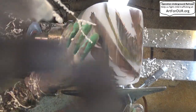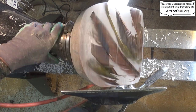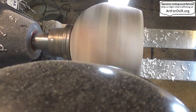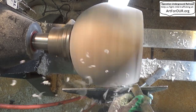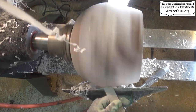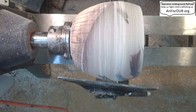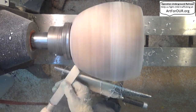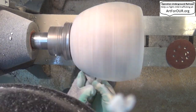One thing I've never tried before: I usually sand from 40 or 60 grit up to 400, 800 grit, and then go back down to 600 grit or so on the wet sanding and work my way up to 2,000. I received a donation from some fine folks with some turning paste. I thought I'd give that a try. I never tried that before, and I was pleasantly surprised. I probably need to learn how to use it better. I think I needed to sand this clear resin more. Boy, it shows every defect.